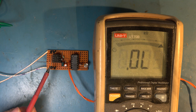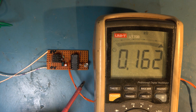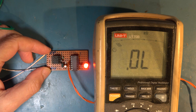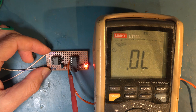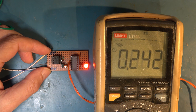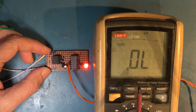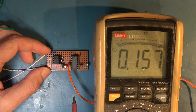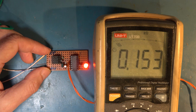We have a 555 timer with a roughly 50% duty cycle and a reasonable period. The output from the 555 timer on pin 3 goes through to this 4066 analog switch, and the output from the analog switch on pins 3 and 4 is going to the multimeter. When the LED is on, the signal is made — we get about 150 ohms on these orange wires. When the LED is off, we go to open circuit. So I'm hoping this will activate the record button via these orange wires every second or so.